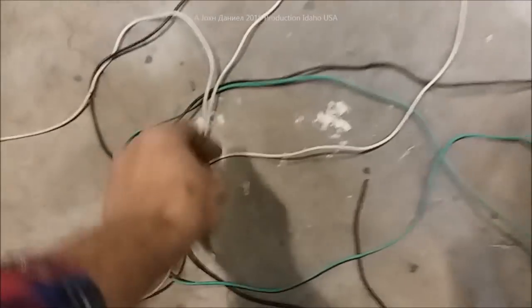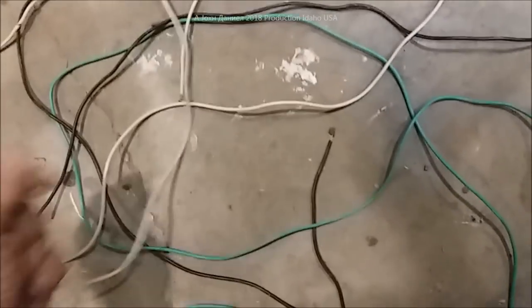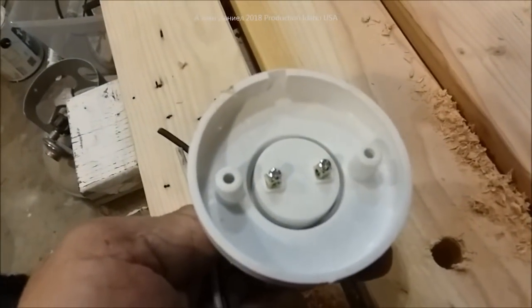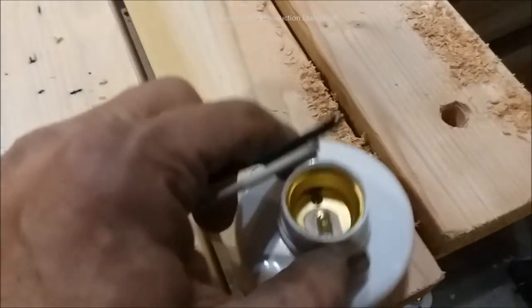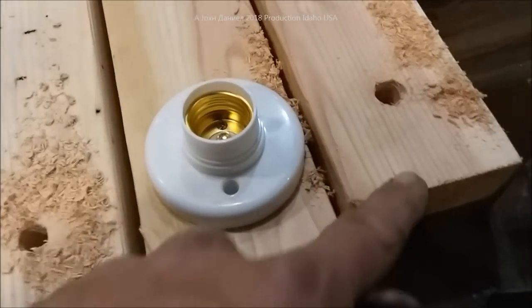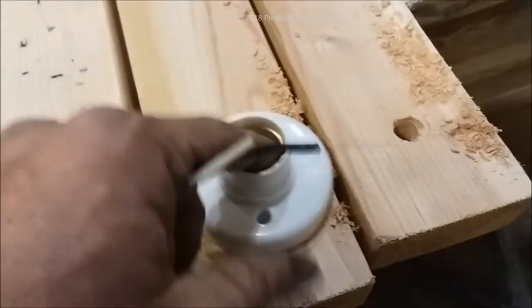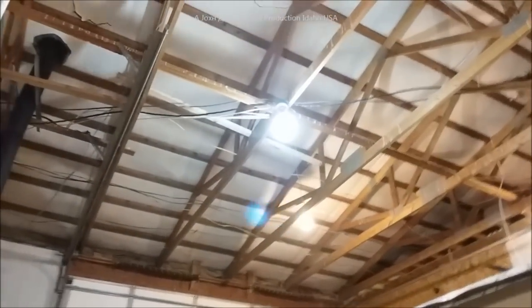We're just going to get the light fixtures mounted up here and I'll show you how it's done. What we're doing is just taking apart the wires out of a 16-gauge cord — we'll just have a cheap 16-gauge cord. I'm going to pull the black and the white out of it and then attach them here and go through this hole and drop them over. The wires will come out and down along one side. I'm going to nail off 14-gauge wire on the side with a pigtail to plug into the original wiring up here, so when I turn the switch on all this runs.